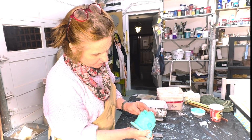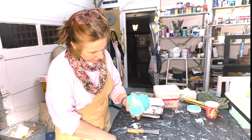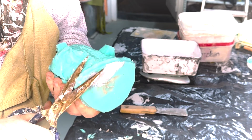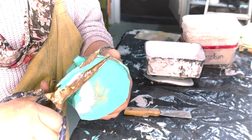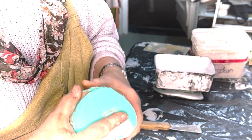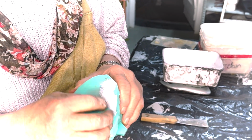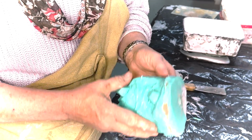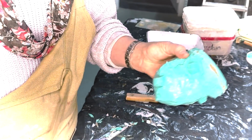The casing has to come off really easily. So for instance, there's an undercut there. I'm just going to trim and simplify this mold. Because of the silicone running down, we've got too much silicone here. You can take all of that away. This is actually going to be our pouring area where it's very thin. So I'm going to reveal that. I want to see where we're pouring, so that I know where my next pouring spot for the casing is. It'll all make sense in the end. It just does take a while to understand.